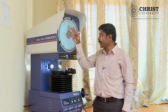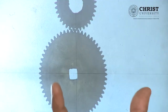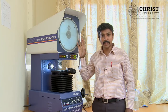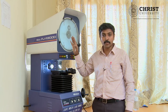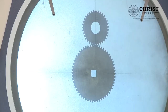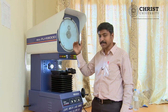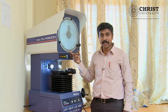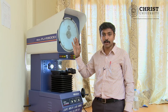I have measured four quadrants for my pitch circle diameter. Take an average of all four — that will tell you the correct value for your pitch circle diameter. Do not conclude with one iteration, as that will provide a lot of bias. User judgment is variable based on eyesight, and users also have parallax error. If the person is standing at a slight inclination, that will provide a different perspective than someone standing exactly face to face with the equipment. Parallax error should also be avoided — educate your user before starting the measurement.